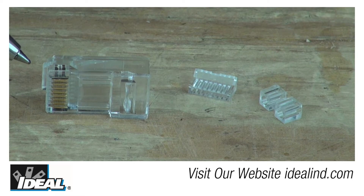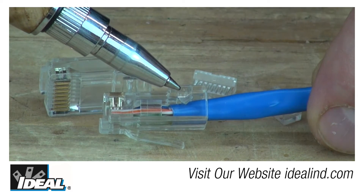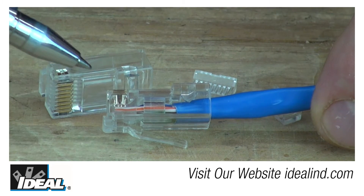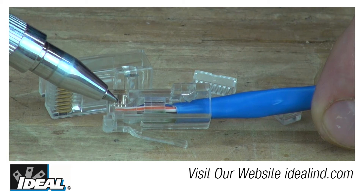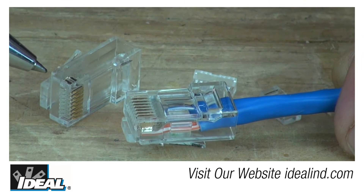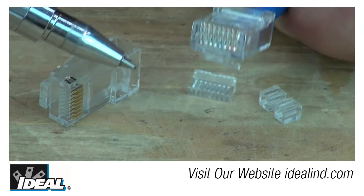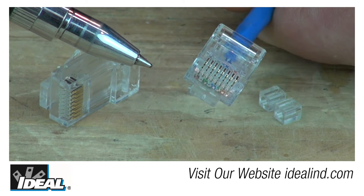That's not always true with some other brands, which means our pins can be inserted and extracted quite a few times before wearing through the gold plate. Here's a completed plug: the strain relief is fully seated on top of the outer jacket for pull-out strength, the sled device is in there, and the liner is in the front. The liner holds the conductors in place and the pins pass through a slot in it to make solid contact. All gold pins are fully seated after crimping — if the crimping die wears out, pins won't crimp evenly, so take a couple seconds to verify all pins are fully seated. You should be able to see the shiny conductors through the clear front.